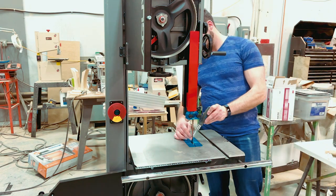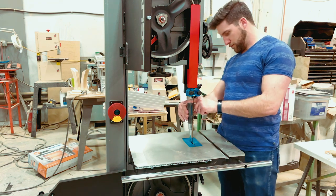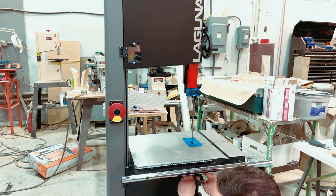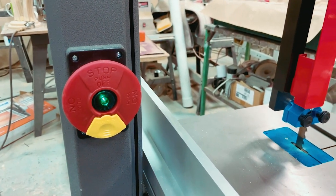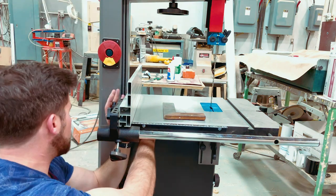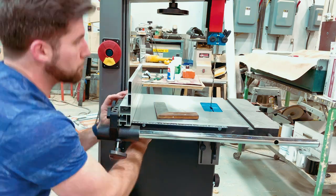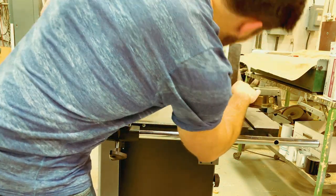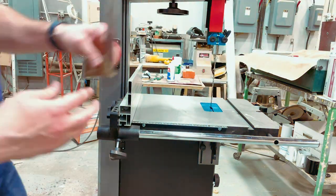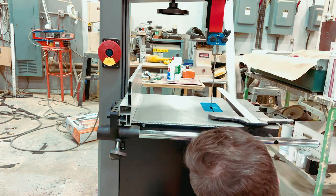Next I put in my guard. Like I said before, that one is a little low — it's slightly inset into the table. That's better than having it poking out depending on what you're doing, but I still think I'll probably shift it up to make it as close to flush with the table as possible. To do that, likely all I have to do is put a piece of tape or two underneath. Next up I'm going to get the table level and make sure it's perfectly square with the blade. You can use a level, but it's better to just confirm that it's square by using a square and the blade — because if your bandsaw is on slightly unlevel ground or skewed in any way, leveling it won't give you 90 degrees. So just square it up, square up your fence as well in case you need to shim that, and you should be good to go.